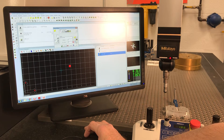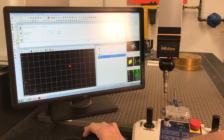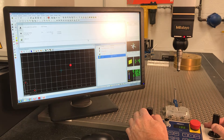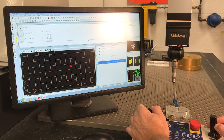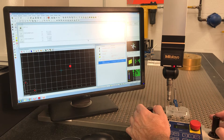I want to check — I wasn't the last one to use this — let's change it to 'four top of part' and hit OK. Keep in mind we're in full CNC mode so we don't know where it was parked last time. I'll come up here and say I want to go to this point, so when I start the program it goes there. Because I've got a clamp in the way, I want to come over here out of the way. I'll hit Go To, then start touching off on the top of my part to do my plane.